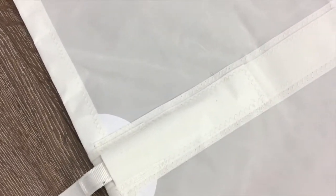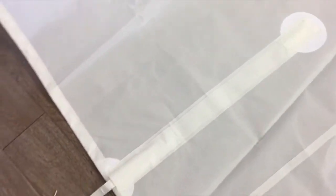And while we're here, we'll take a look at our batten pocket configuration. Notice that these batten pockets are sewn directly on top — there's a bottom to the pocket and a top to the pocket, so that batten never actually touches the sail itself. And then we've got the reinforcement at the end for the partials. It's really the way to do it, guys. If you're looking at another designer and they don't show you that sort of detail, perhaps you should give us a call. That's the way we do things here.